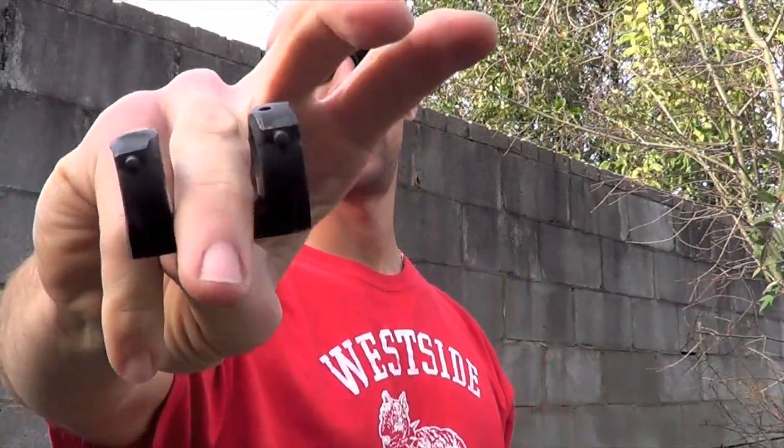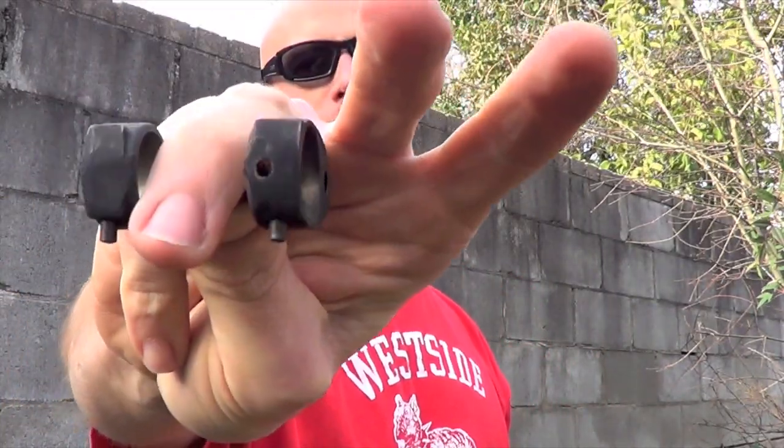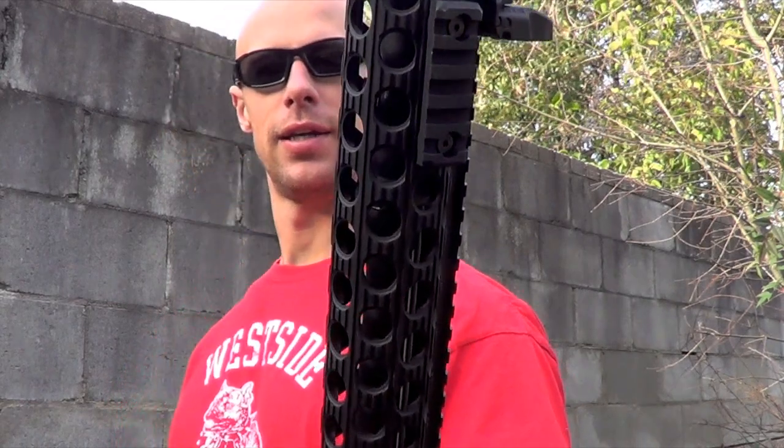I went ahead with the bluing process 2 more times, and this is what we ended up with here. You can see there it's pretty even across the board, but there are some spots that kind of need to be filled in still. What you're gonna do now though is I just go ahead and put it back on the barrel, and as you can see there I got the pins because I'm ready to knock it in. I'll put it back in the barrel, pin it in, because during that process you're probably gonna nick something up, maybe one little scratch here and there, and then I go over and reblue the whole thing while it's on the actual rifle itself.